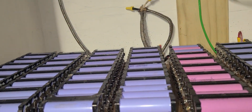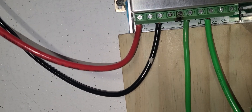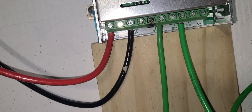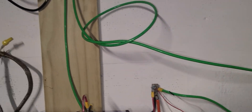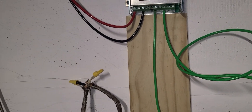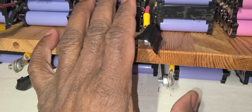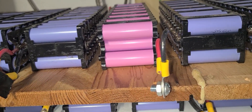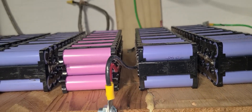This battery uses 10-gauge wire. The other wires — the ones coming from the solar going to the batteries — those are 8-gauge wire, the green ones. I couldn't use red and black for everything, but I know which wire is which. This is a lithium iron battery pack — about 14S.